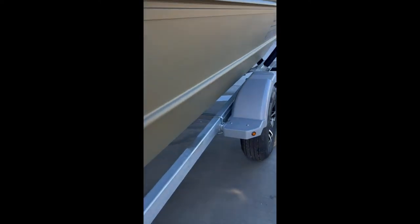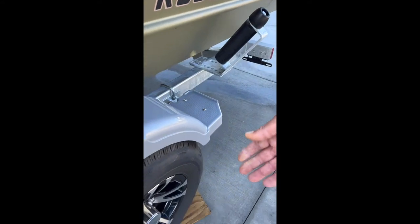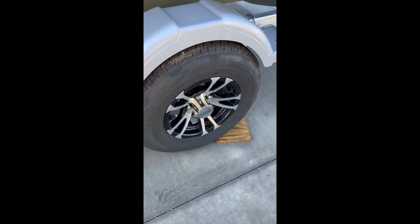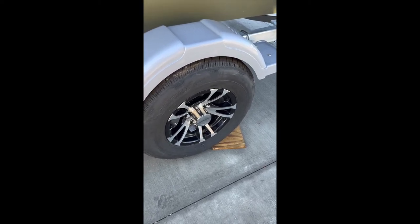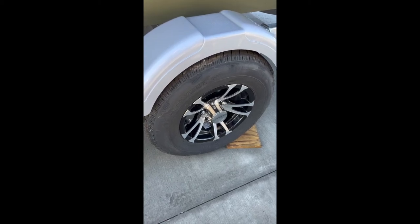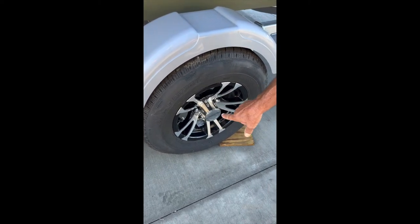You have the LED clearance light on the side. You have your galvanized trailer with the galvanized load guides. The custom aluminum wheels go with this trailer package. The lug nuts have been tightened to 115 torque pounds — you want to check those every 500 to 1,000 miles to make sure they seat well. To get to the bearings to grease them, which you should do every six months with a couple dabs of grease, you have to take the wheel completely off to get behind the cap to hit the Zerk fitting.